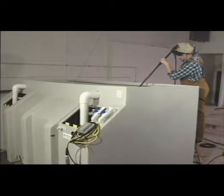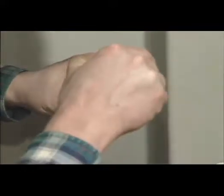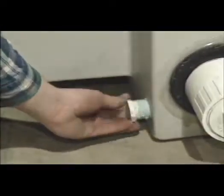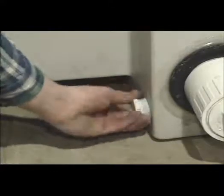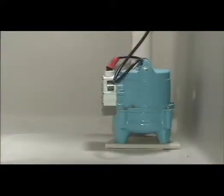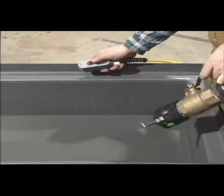Some truck stations use a storm sewer vacuum truck to suck up any salt left over at the end of the season — this works very well for fast, easy cleaning. When the hopper tank and main brine tank are empty and clean, put some pipe dope on the threaded plug and screw the plug back in. If the system is to be stored outside, leave all the drain plugs out. It is extremely important to flush the pump at the end of the winter season in order to keep the pump in good operating condition.